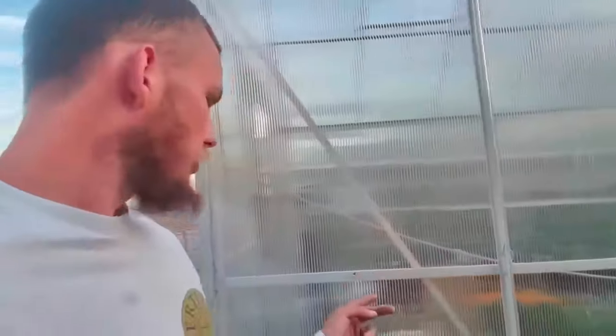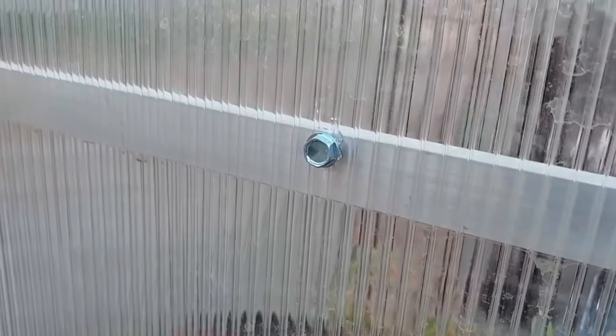There's one more little stability issue that's common with these greenhouses — the panels. They often unclip and can blow away with a good gust. So we put a simple little number 10 tech screw in each panel, and that takes care of it.